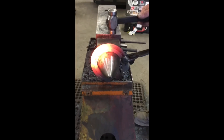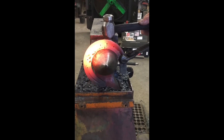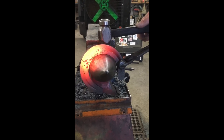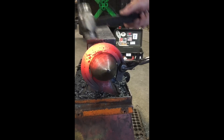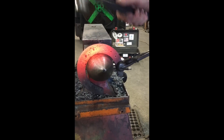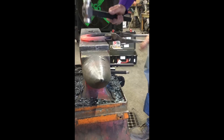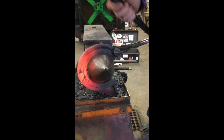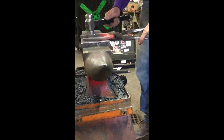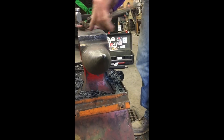Clean up heat. To clean up, I want to clean up on the back of the horn and I want my shoe to be open — you always want to clean everything up with flow and openness. It's hard to pair up shoes when you're kinking and always tightening up your circumference. So I'm going to go from fuller, flip it around to fuller, and I've been opening it. Now I'll go from heel nail to heel nail, opening all the way past the toe clip, doing the same on the other side.